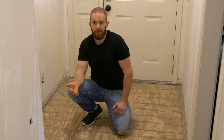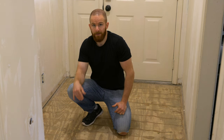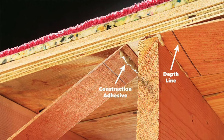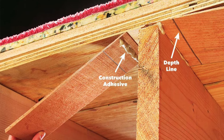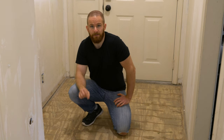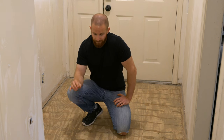To repair this, if you don't have access to the subfloor from the top, then you're simply going to have to wedge the gap from the bottom. You identify where the squeak is coming from, and then you're going to want to wedge it with a shim on the bottom side. You can also apply some adhesive to make sure it stays in place. That's typically what you do from the bottom. However, that's not really a permanent repair — oftentimes the squeak's going to come back.